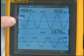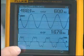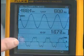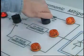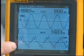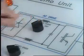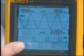Now we can take a look at the line currents being produced by this drive. What we see on this display is the line-to-line voltage between phases 2 and 3, and the line current on phase 1. This is the line current for the AC drive when we're in 6-pulse mode of operation with the DC link choke and the 5% line reactor in the circuit — something you would typically see in the field. When we switch the line reactor out of the circuit, we see that the line current has a lot more ripple. Now let's see what happens when we switch the DC link choke out of the circuit — we see a major change where this goes to a discontinuous mode of operation.